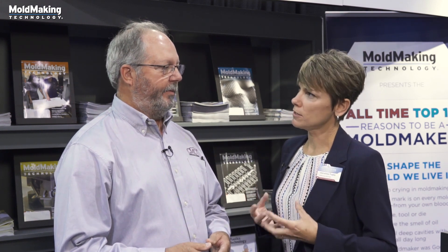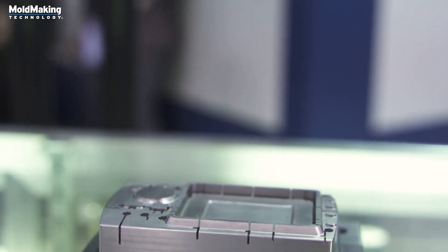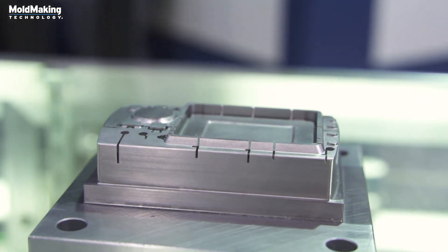So I know you have done a demo with Matsura. Can you talk a little bit about this insert that is part of the demo? We put together a white paper where we worked with a few partners working with Matsura. We've replaced the core in an existing mold for a battery case. It's a 1-inch by 4-inch by probably 4-inch tall core. It had baffles in it — pretty traditional kind of a process. We've got ejector pins, so the baffles run up in the core. We were running an 18-second cooling cycle on that particular part. We were able to take that down to a 10-second cooling cycle, and the parts actually measure better than they did with the previous situation. So we actually sped it up significantly and made a better part — less warp — because we were able to get that heat out of there in a much better situation.